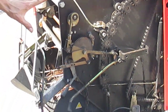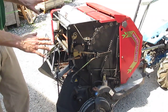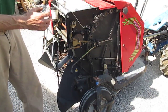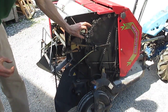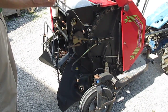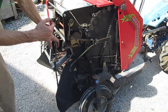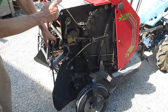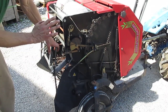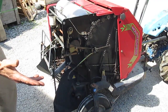The nice thing about this baler is everything on it is completely mechanical — there's no electronics, no hydraulics, no mysteries. One sprocket drives another sprocket. Sometimes the power is shifted from one side of the baler to the other; they use shafts going across the baler to carry power from one side to the other when they need rotational functions on one side or the other. Once you trace where the power is moving and what's moving what, you can figure out anything that's wrong with one of these balers. It's not a huge mystery like some electronic machines where it's a circuit board and you don't know what to do with it.